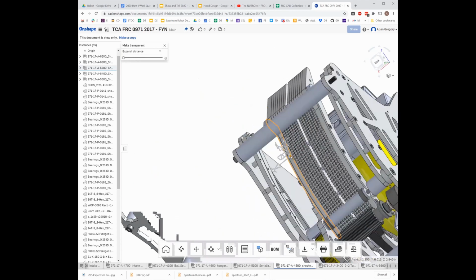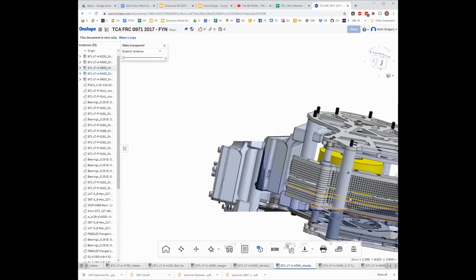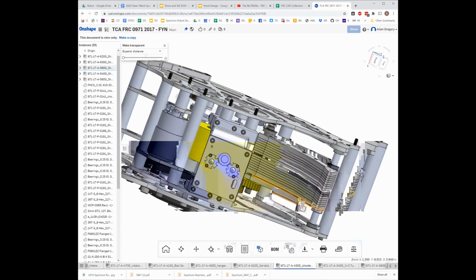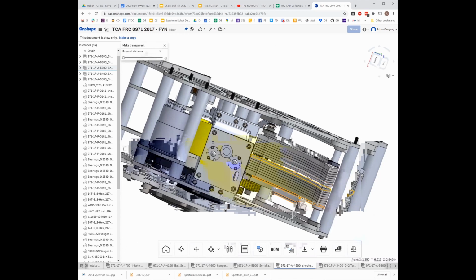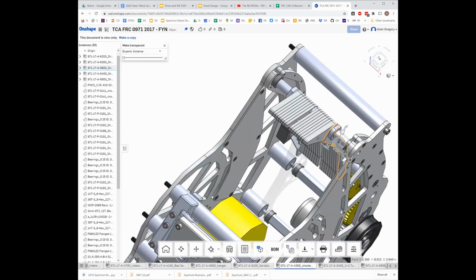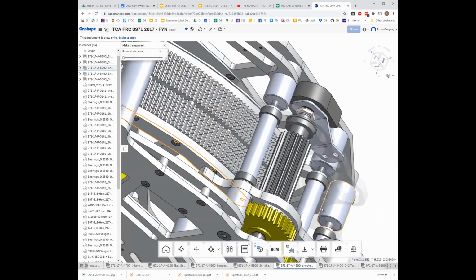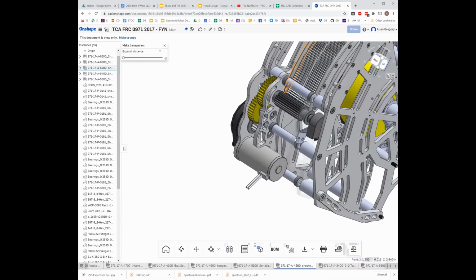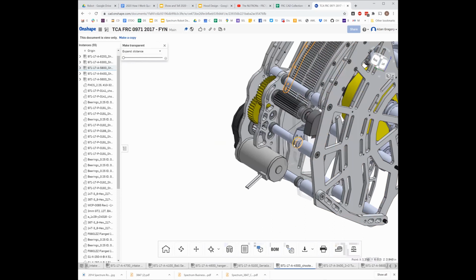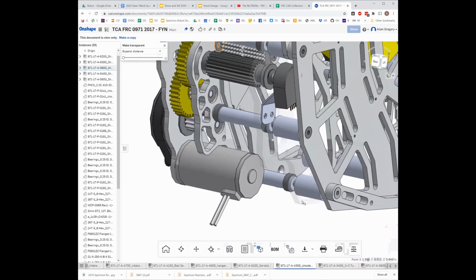In several places, there's, what, 1, 2, 3, 4, 5 bolts going through there. That's one. Oh, I'm spinning around too fast. Okay, yeah, 1, 2, 3, 4, 5. So there's quite a few going all the way through that to make that assembly work. And there's another one: as it comes down lower, the whole rail hits more bearings. It hits these when it's at the very top, but as it comes down and gets lower to where it's shooting more often, there's another set here and another set here. So if the ball's pushing against it, it can't flex backwards at all because it has all that support on the back end.